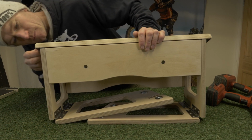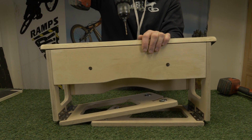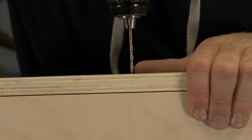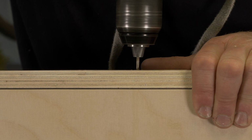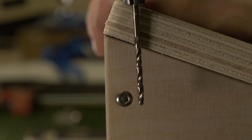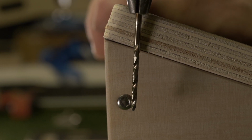Once you are confident the surface deck is aligned in all directions, clamp the deck to the substructure by hand. A partner is very handy for this critical phase. Take the 3.5mm drill bit and with extreme care align and drill the hole through the marker point and into the end grain of the backplate. There is a very high risk of drilling out of a face. Please complete this task with care, attention and patience.